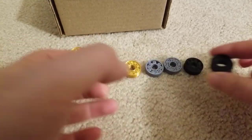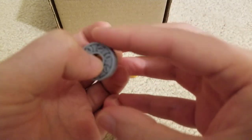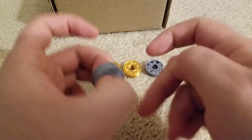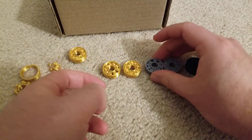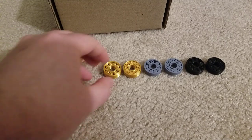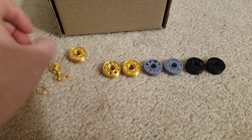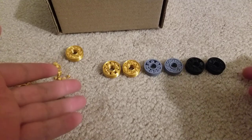The black one is obviously a lot harder to see, so my take would be that PLA Plus in gray worked out the best — I like seeing the moving parts a lot easier, and it rotates very freely. A little lubrication would actually probably help. To make your bearings come out the best: lower your layer height to 0.1mm or lower if you can, and a smaller nozzle size will help as well, though it'll take longer to print. To print two of these bearings is about an hour and a half to two hours at 0.1mm layer height, including printing the raft underneath.